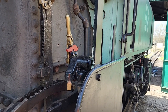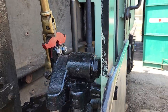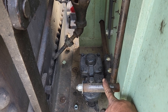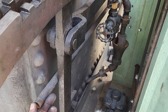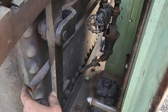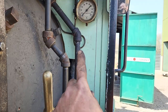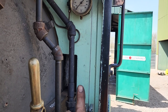I'll show you where we're at right now with the project. The brake valve has been installed. I have some piping in place here going down to a feed valve, and that will take the pressure from 120 down to 90. We have this pipe here, which is what remains from the steam brakes, so I've got to cut this back and route it in and come up into here. There is also a brake pressure gauge there, and I have to put a T in that line to go up to the pressure gauge.